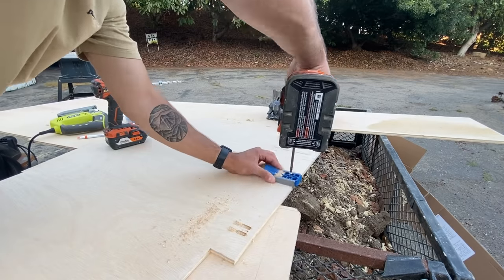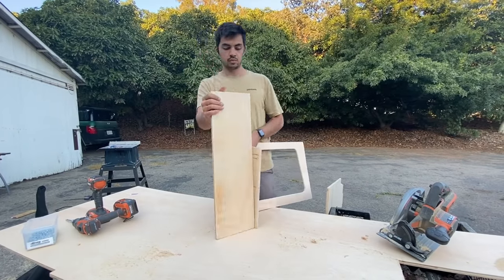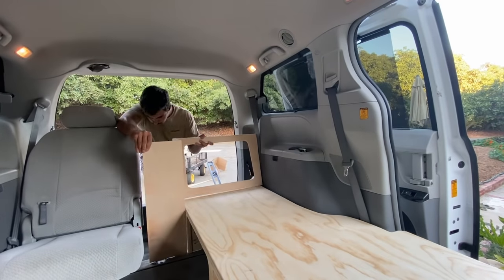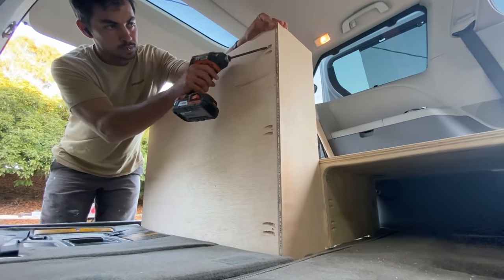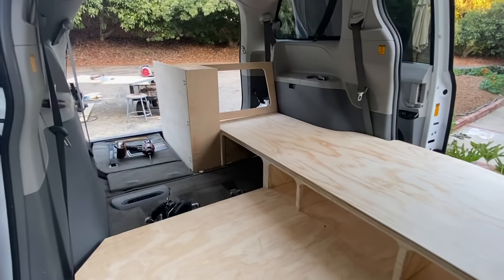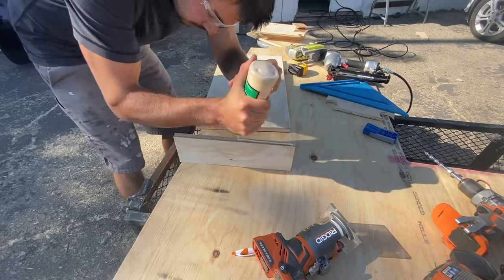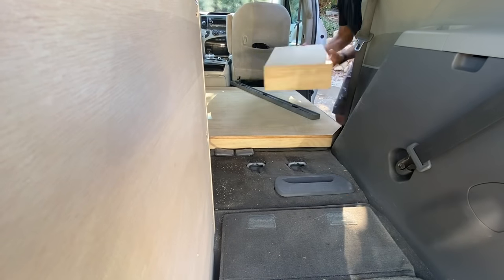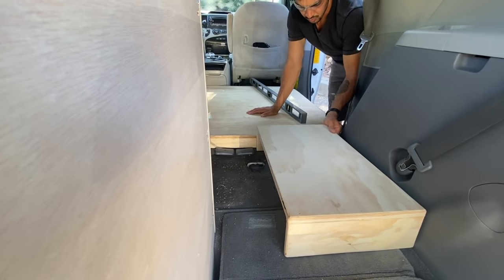After I got the big pieces cut, I added pocket holes to those as well and then started dry-fitting some of this cabinetry together. I brought it over to the van and test-fitted it to see if it would work, brought that back seat up to see if it would all come together right, and once again everything looked perfect. So there you have it — the back cabinetry is kind of dry-fit in place so we can visualize what's going on. After the cabinet was in place, I moved on to build a little stage for the refrigerator. It's a top-opening fridge, so we wanted to buy a little bit of storage underneath it by adding this plywood stage to hold the fridge up.